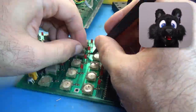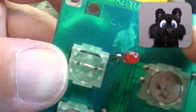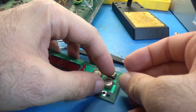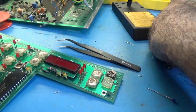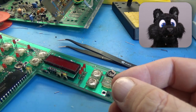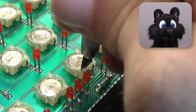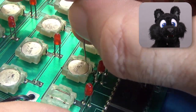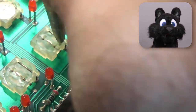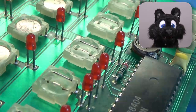The pushbuttons are domed switches, and their semi-transparent cases made me see that the insides would be pretty corroded. So I decided to remove the domes, clean them, and reassemble. Well, that worked — almost. I'm glad that the board seems to be the same for all models of the series. Two of the domes didn't want to spring anymore, but my version has several unused switches so I could leave those open.